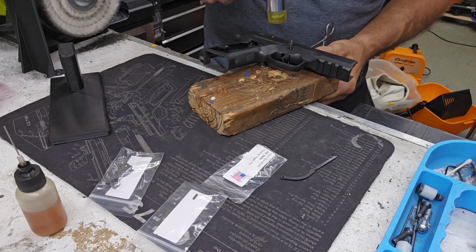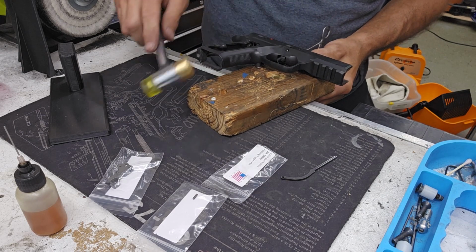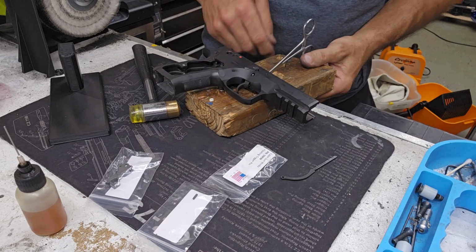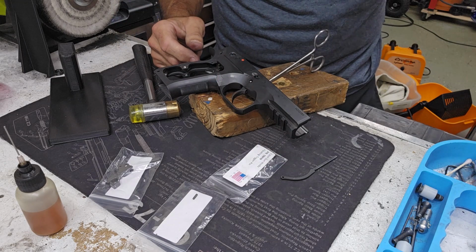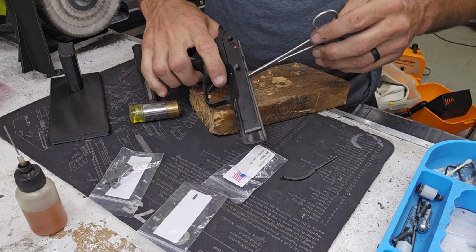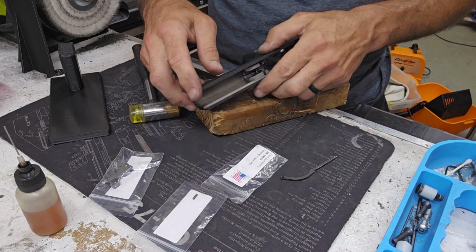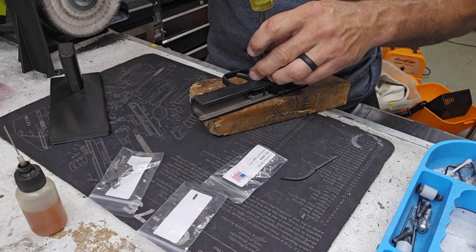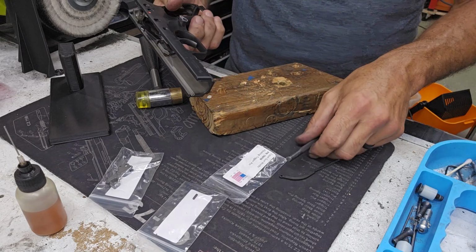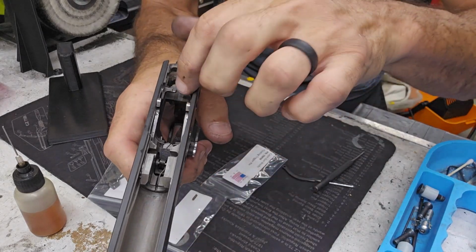And then it's a one punch, confident one punch. That's it. Now my punch is out. And I said one punch, one strike, right? One hit. I can take this off. My trigger return spring is secure. Use a punch to drive the rest of the floating pin in, and your trigger bar is reassembled and reinstalled.